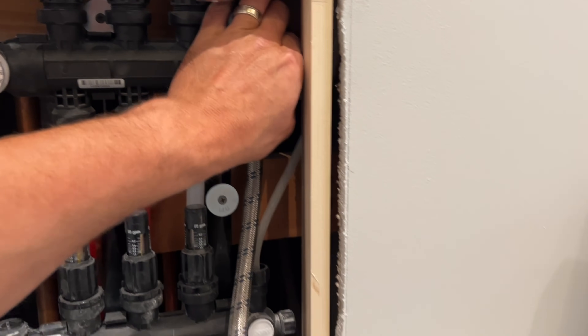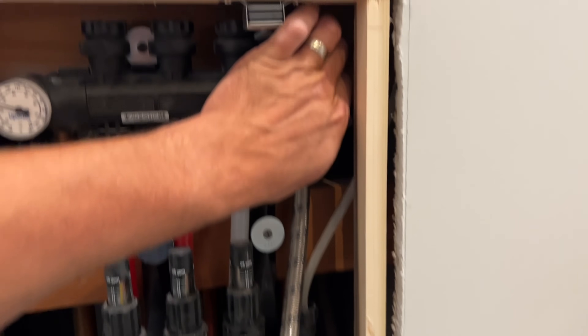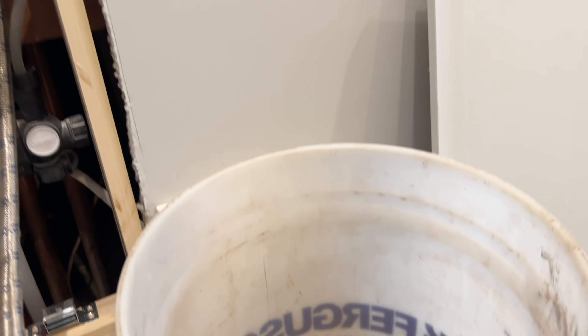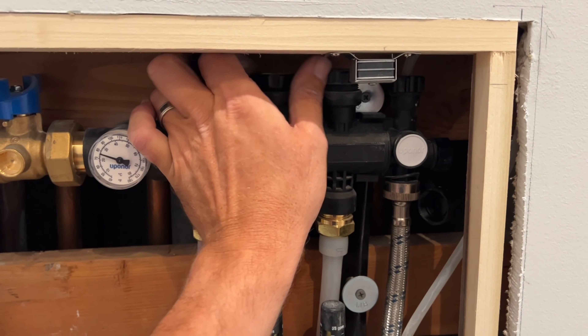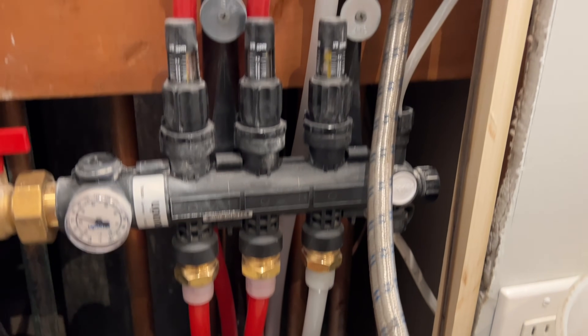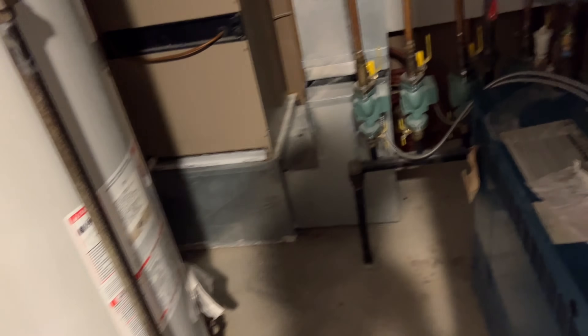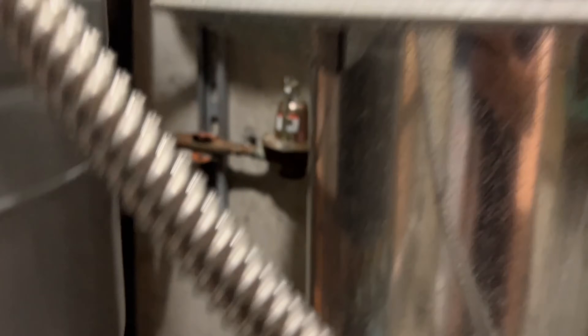You can also bleed from here with a little hose to a bucket — I like using the hose, it's faster and easier. I'm going to open this valve, close the others, and do one loop at a time. I need to add more pressure to the boiler as well. Daniel's going to keep an eye on things up there for me. There's my pressure-reducing valve — I'm just going to crack that open a little bit. That's the manual fill valve right there.